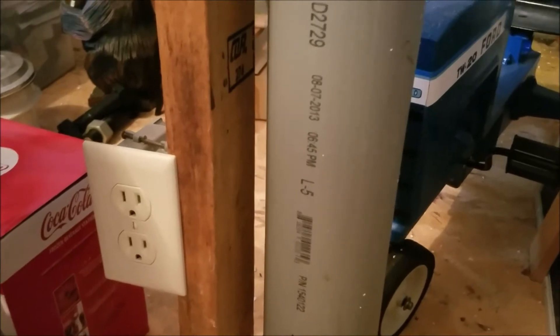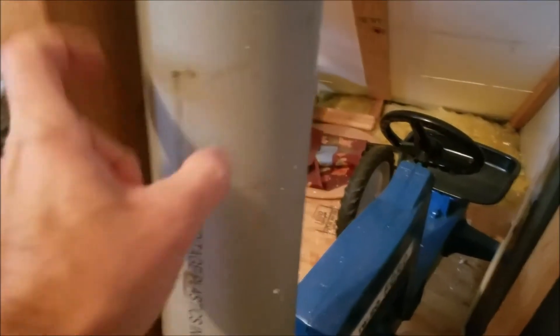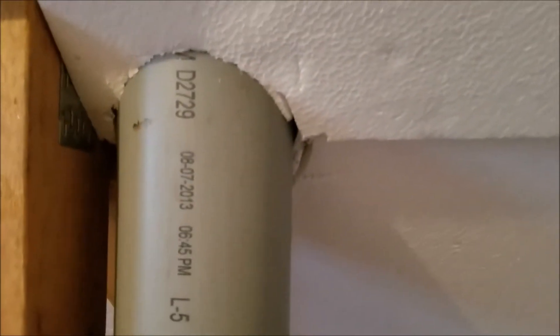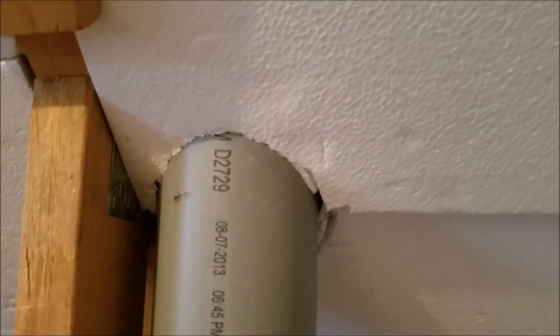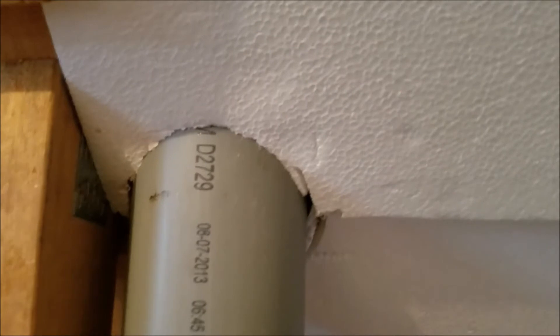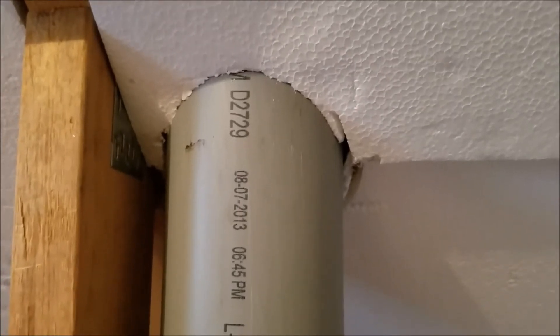Using that outlet, I could put a pump somewhere in the system. This is four-inch PVC — the really thin-wall stuff, cheaper and a little lighter to work with. I wrapped it in some cheap insulation and went through the roof right here — drilled the hole through. On the outside it's just a plastic roof vent piece, and then I put a cap on top.